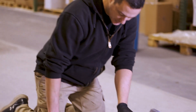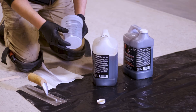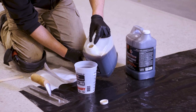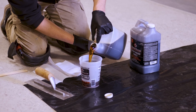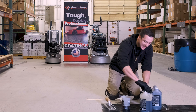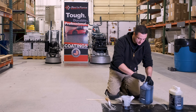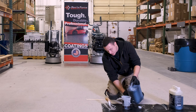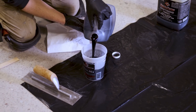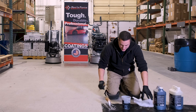Kicking into gear here, I've got my knee pads on, got my gloves on. This is a one-to-one polyurea and I'm going to come up to about 16 ounces — so eight ounces of A, eight ounces of B. This specific product I'm only going to mix for about 20 or 30 seconds. I'm not using any sand when you're doing a grout coat — you only want to use resin, only liquid — because as soon as I add a grit, a sand, or any other kind of aggregate or additive, then I'm not going to be able to pull this tight.